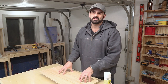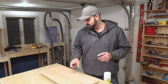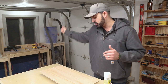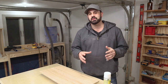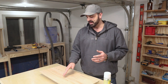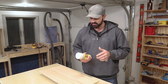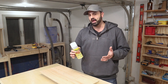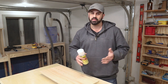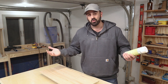My plan for this sign after it's done engraving on the CNC is to take some black spray paint and spray it into the engraved area. Once that has dried, I'm going to take a torch and char the top. One issue I've run into in the past is that the spray paint can bleed to the sides, and sanding doesn't do much. So I'm going to try adding a coat of shellac first, which should act as a barrier — making it easier to sand down and reducing the bleed. I've never done this before, so we'll see if it works.